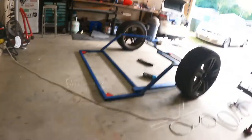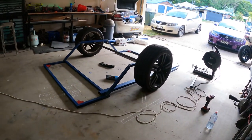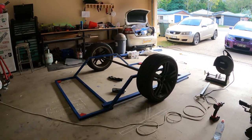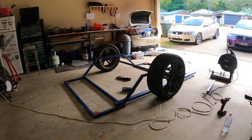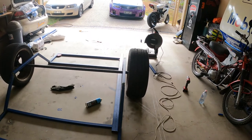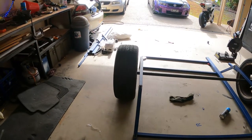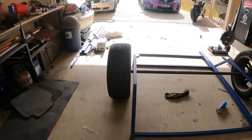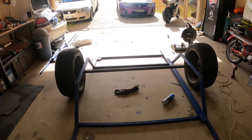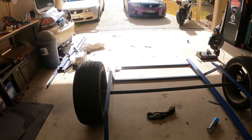Okay, so yeah, we're pretty much at the point now where we're laying out the frame with the trailer. So, there it is. So, got the VE wheels and the axle all set up in there. Worked out clearance from the chassis rail. Now, the axle's not exactly 100% perfectly centered, but there's roughly about 42 and 38, so 40 mil roughly either side.